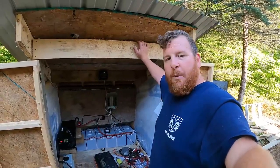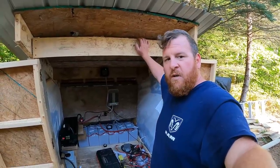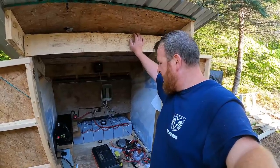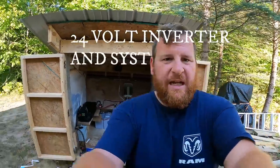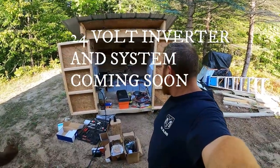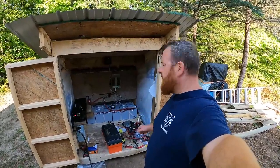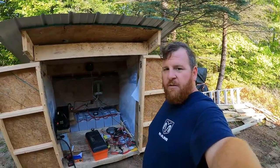I think we're good. Jenny was charging the Bluetti down at camp just on the small generator because she wanted to make sure she had it for work in the morning, just in case I didn't get this done. It was about 80% full, so I brought it up here the rest of the way and we're charging it — drawing 200 watts. I know converting DC to AC and then back to DC to put it on the Bluetti is not the most efficient way to do it, but we're just kind of testing the system. I have a 250-amp ANL fuse on there, which I know is overkill considering the jumpers between the batteries are still 6-gauge. But I'm not going to do any high draws on this until I get that upgraded. So we're back to operating — it took most of the day to get that operating. Thanks for hanging out with us guys. There are our solar upgrades for the day. If you have any questions shoot me a message or a comment. This is a way cleaner setup, and once I get the heavier gauge wires between the batteries it will be a really nice setup. So far so good — thanks for hanging out with me guys.